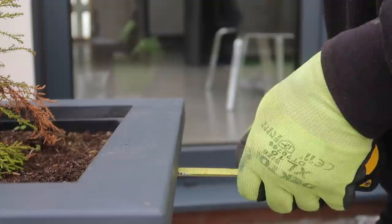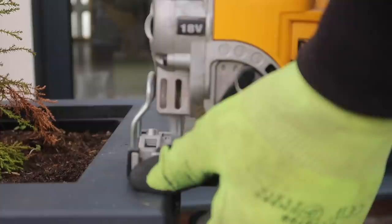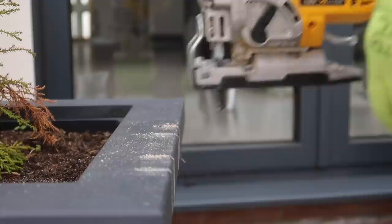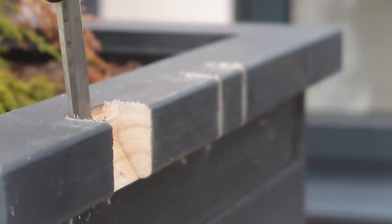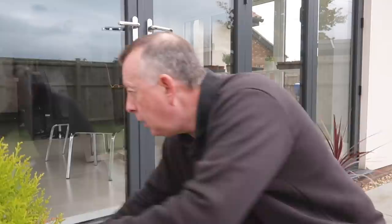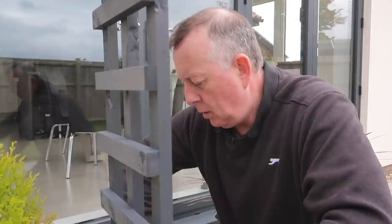The overhang I have on the top piece is 25 millimeters, so I also mark that on the top where I'll stop my cut. I get quite a tight fit on this, but you don't necessarily need to.